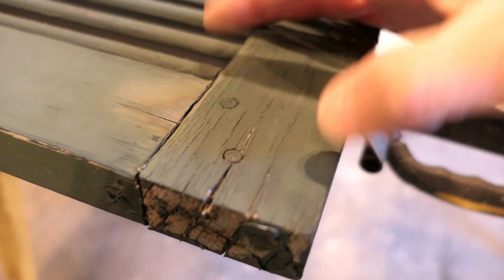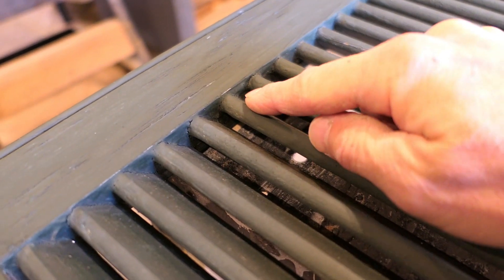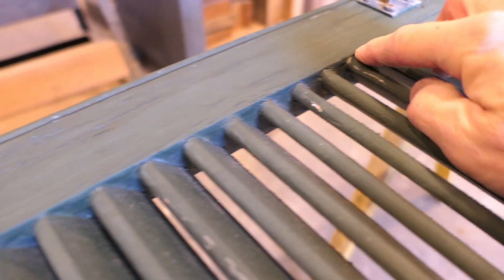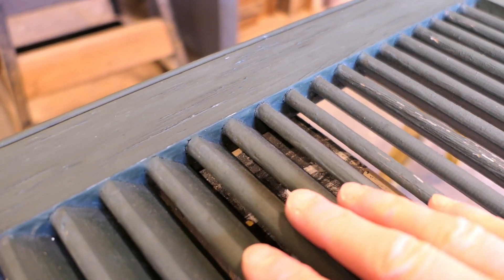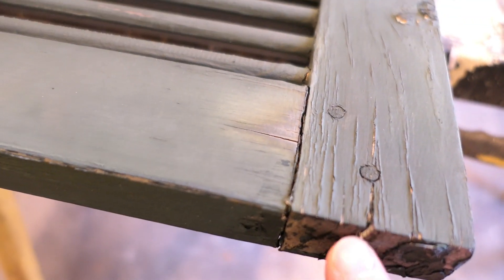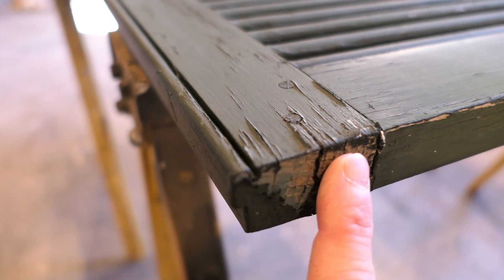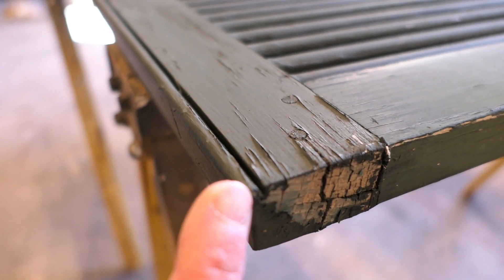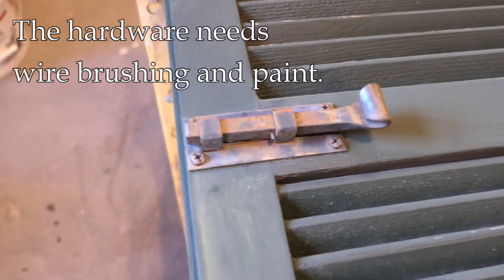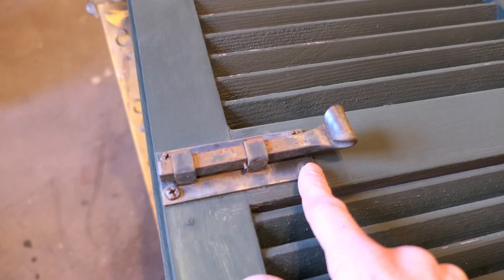As the wood deteriorates, the joint is going to fail. The louvers were also mortised in place and look pretty good — I don't see any rot there, it's held up well. It needs painting and sanding, maybe some scraping, but it's mostly these joints where the wood has deteriorated. There's a bead profile right here, so when I do some sanding I have to be careful not to remove or destroy that bead profile. The hardware also needs some help — I can remove it, sand it down, and paint it.